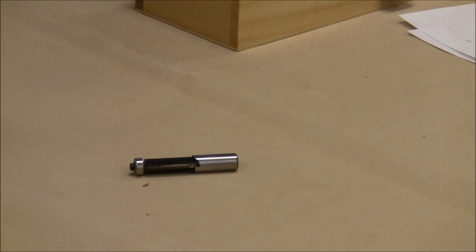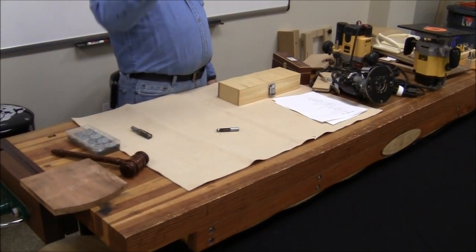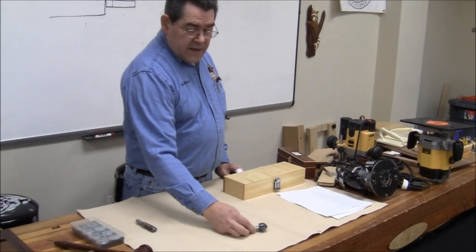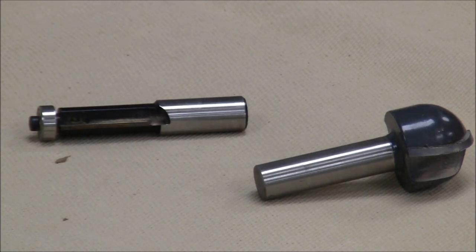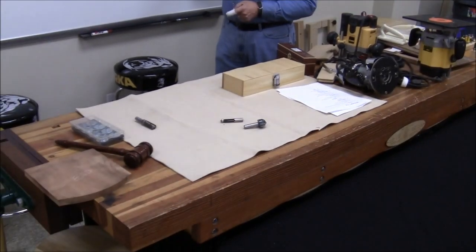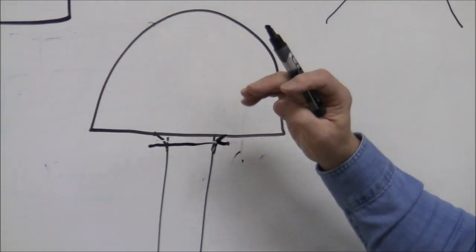If the bit is out of balance — same story as with an extender — the farther out it is, the more vibration you're going to feel. You will sometimes hear people say, oh, just drop the bit all the way in. Don't drop the bit all the way in. There is a rounded edge on that bit where it was machined. If you drop the collet all the way in to where it's on that slope and tighten it, a little bit of vibration and the bit moves up and now it's loose.